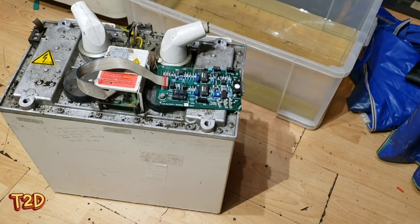A couple of the problems we're facing here: we can't just take out the diodes and the doubler from this and feed our AC onto those terminals, because the cables for these are rated for DC and they won't handle high frequency AC. I've tried before and they just break down - they get corona and they get damaged with burning and tracking. So we can't do that.